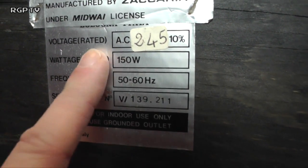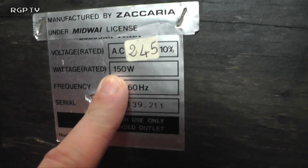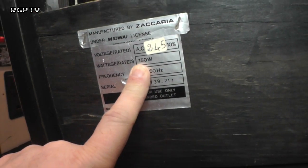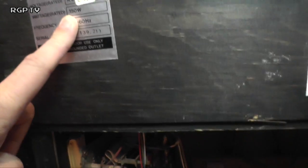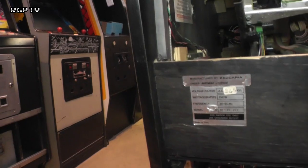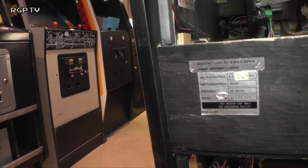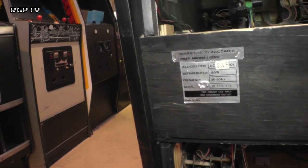V139, so yeah, uses about 150 watts. That's its maximum load rating, by the way. That will also be based on inrush current. So when you first power the cab up, there's a ton of capacitors on the monitor and in the fluorescent tubes, and those two big capacitors down there, and when they all charge up, it'll draw about 150 watts for just a few milliseconds. Basically, that's it. And then it will go into a lower power mode, which will drop to about 105, 110.